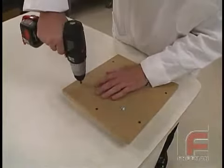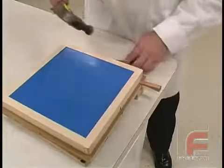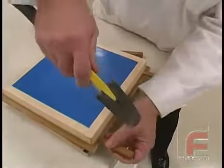It has been a little over an hour, so the Repro-NS hasn't fully cured — it is still a little warm and very slightly flexible. This is the ideal time to demold, since the material will give a little during the process.